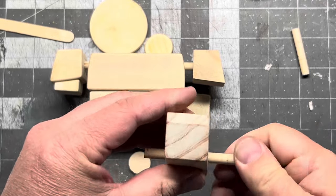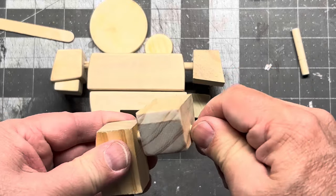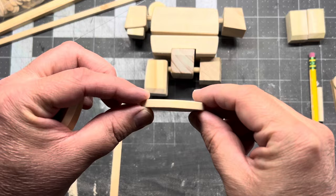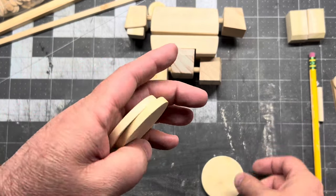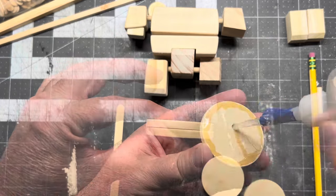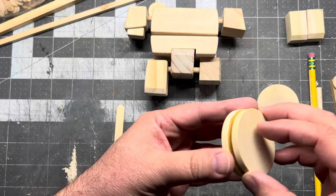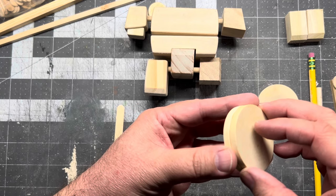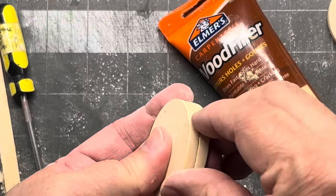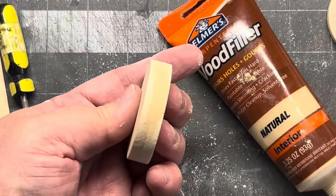If you're using a hand drill, chances are it's going to drift on you up or down and parts are going to go weird — I've done that in the past. Everything's lining up pretty nice. I was going to use just one disc for the head, but I thought these two discs look a little bit cooler, a little bit more volume. So I'm going to glue these together. I didn't love the seam around the edge, so I took some wood filler, filled that, let it dry, sanded it down, and it worked out pretty nice.